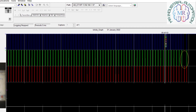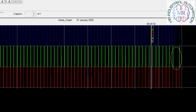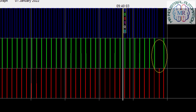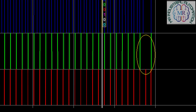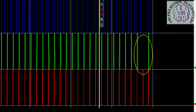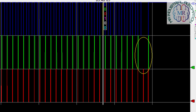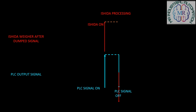The next is slave interlock mode, in which the weigher discharge is initiated by receiving a signal output from the packer. So in the slave mode we have to give a short signal — more than 50 milliseconds — to the Ishida weigher. It means we have to turn on one output for more than 50 milliseconds from our PLC and the Ishida weigher drops the product as per the set weight. So if in the slave mode we need 10 dumps from the Ishida weigher, we have to give 10 short signals to Ishida.